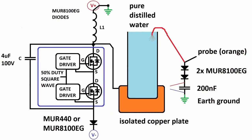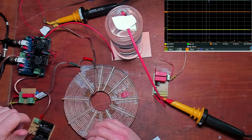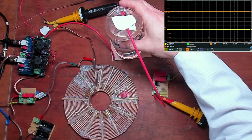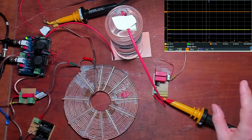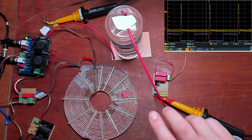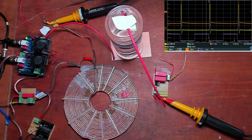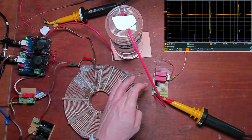For the next test I'll reverse the circuit to produce positive impulses on the copper plate, which are transferred through the water into the capacitor. I'll turn the system on — now watch the orange lead jump down and slowly rise up. That is the voltage on the water, on that probe, and it charges up the capacitor. You can see the voltage rises again from negative 1200 volts. Once they are charged I will discharge them — I'll turn the system off and discharge the capacitor with a bang and a flash.